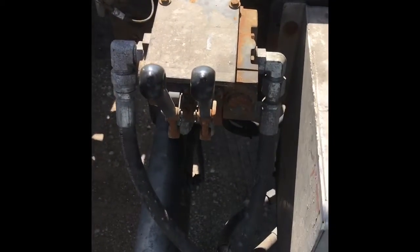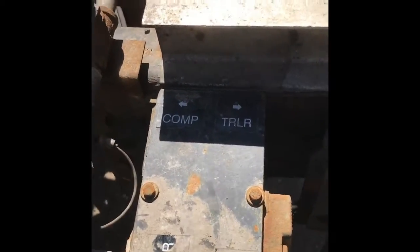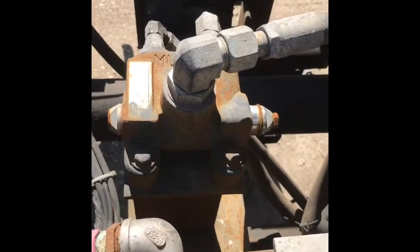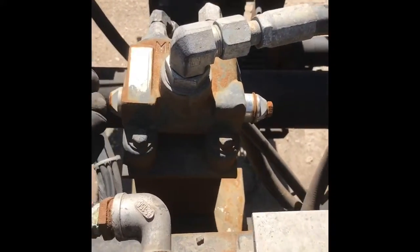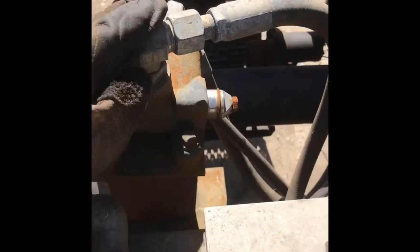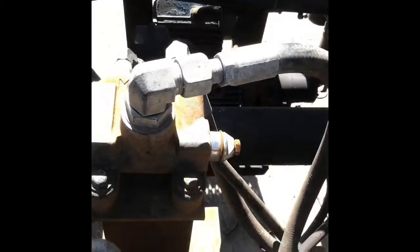My setup can actually accept two more controls if I wanted to add another separate pump. If you look at the top, I've marked why it says 'trailer' and 'compressor.' I bought a separate valve — not cheap, I about had a heart attack when they told me the price. What this valve allows me to do: if it's pushed one way it runs to my hydraulic fittings to run the trailer; if I push the knob the other way it runs hydraulic down to the air compressor. That's what the compressor/trailer label refers to.